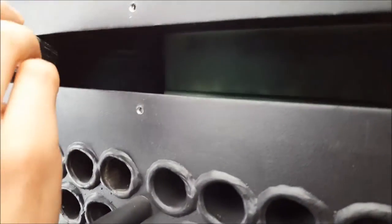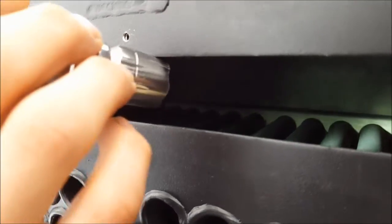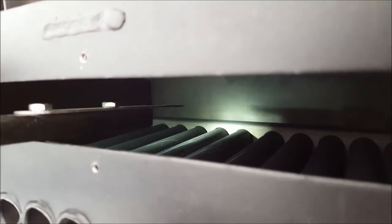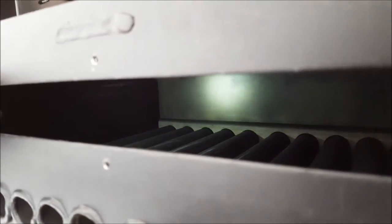Looking inside of the top of the heat exchanger, you'll see the top of the 18 tubes, as well as the very top of the machine. The top of the machine will get quite a bit of debris built up, so utilizing a scraper tool. Clean that area as best you can, also ensuring you get the sides. Based on the amount of debris, it will fall in between the tubes up top, to help guide some of that debris down towards the lower section.